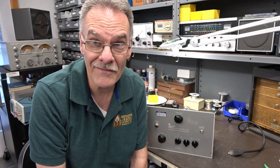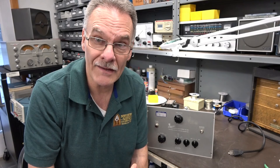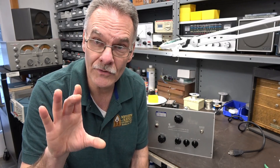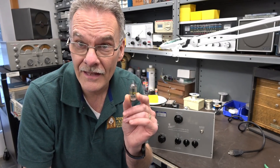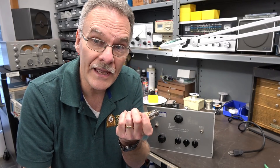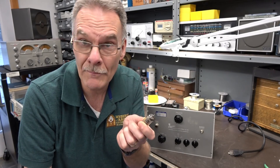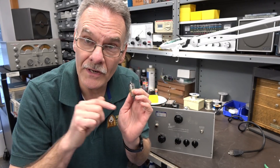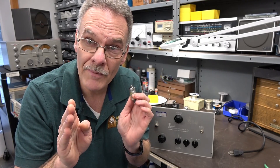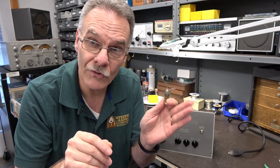It's no surprise to me to hear that the amp is suffering from gain. The 6L6 does require a little bit of drive on the grid, and by the time the signal passes through the tone circuits the amplitude is a little bit too low to properly drive that output tube. So we need another single triode — say, post tone control amplification.